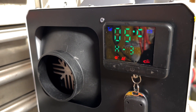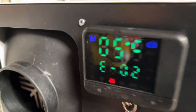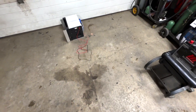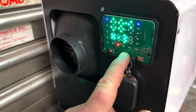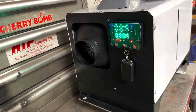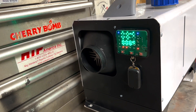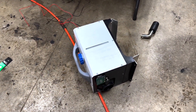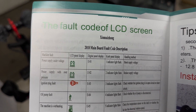You see the fan come on? Glow plug is lighting. What does that say? E02. Shut her down. Depends on where you go on the internet — some say E02 is under voltage. Here's a manual that says it is over voltage. Doesn't matter.